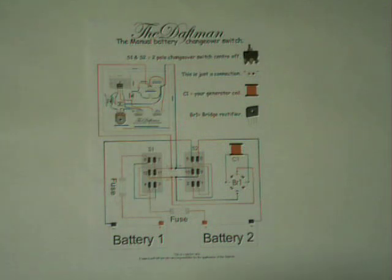There is one other thing I'd like to mention. When disconnecting and connecting batteries — especially wet cell batteries — they do give off a gas. If you create a spark whilst disconnecting, you could actually have the battery explode in your face. The way around this is to use a switching circuit so you switch everything to the centre/off position before disconnecting any batteries. This is very important with wet cell batteries such as motorcycle batteries, car batteries, and buggy batteries. I've been out to jobs where batteries have exploded — the explanation is the person tried to disconnect while power was still on, got a spark, and the battery went up. Please be very careful.